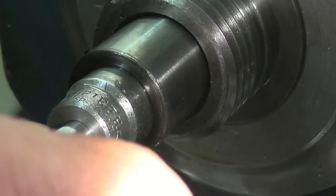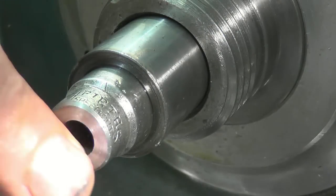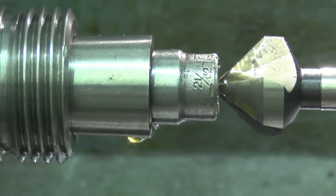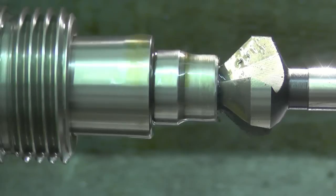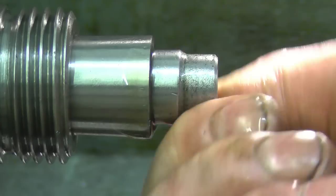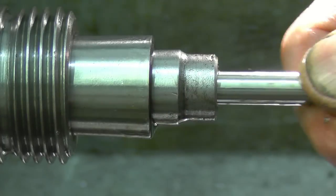That's better. Right, it's in there — so I can drill and tap that, put a grub screw in and it'll hold that nice. I'll just countersink the end of the hole — just enough to break the edge, that's all it needs. Lovely. It's a nice fit in there. That's still a little bit warm — when it cools down it'll be a really good fit.